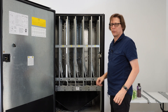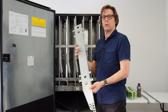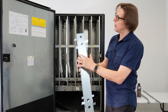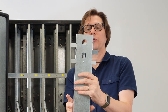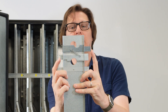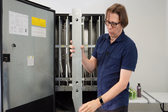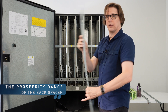Now I need to make the adjustment of the back spacer, which is a long piece of metal. You will not need to remove this from the machine to make the adjustments. We're going to adjust it back or forward to keep the product towards the center of the machine, which depends on the length of the product. There are little hooks or tabs that lock into the notches on the side walls. They're spring loaded, so you squeeze those, move it back or forward, and lock them into the correct holes. I walk the back first, then move the top to the front and back.